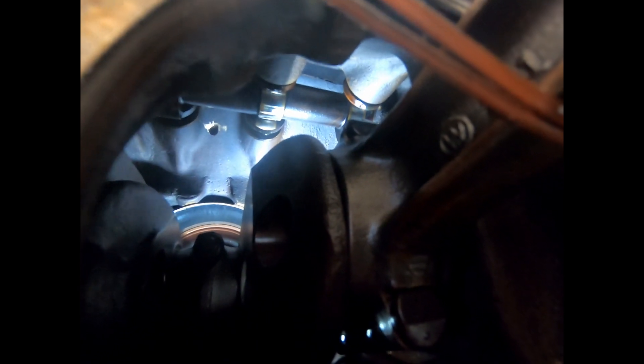Now we can have a good look at the camshaft in there, which actually looks to be in excellent condition. We'll have a good poke around with the mirror, rotate the engine around and take a look at that, and also look at the face of the lifters. I'm very happy with how that looks — very positive.